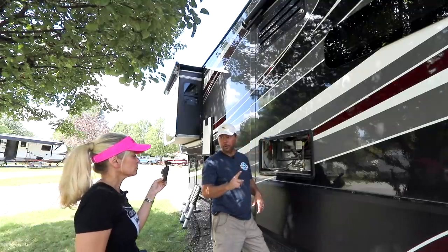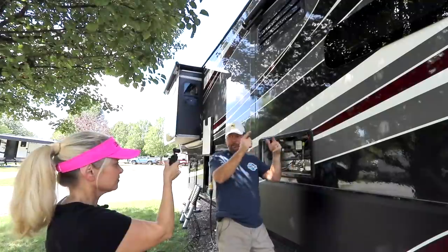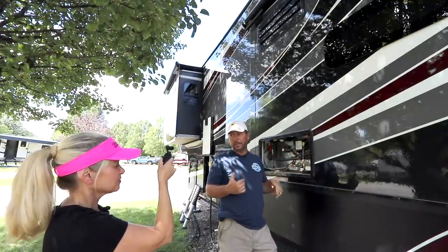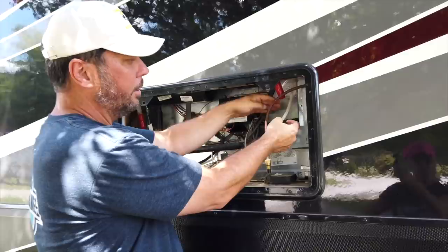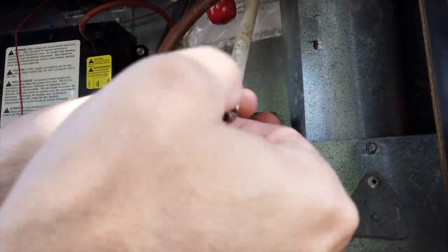Oh, the hose and drip pan. Our pan currently has about a quarter inch of water in it. I think it's because we were just in the refrigerator, letting a bunch of moisture in. Remember how we showed you it accumulating on those fins and dripping out and going out here. But that's actually a good test. We did the inside first, it got moisture in and it's getting the moisture out. We can see it, it's right here. We also have our cap still on our line here, which is what we want. Don't pull that off, it's designed to hold that last drop.